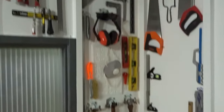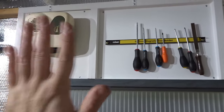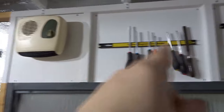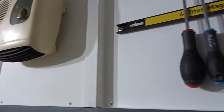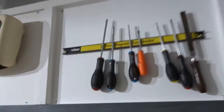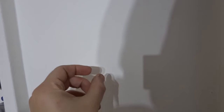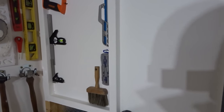The third thing is to board the walls. I've chosen to go inside the studs rather than over the top of them — I'll leave a link to a video on how I did this. It saves space, so you can see the walls are inset and tools sit flush into the wall. This also helps with soundproofing and insulation because it adds an extra barrier. Behind the board there are two layers of bubble wrap, then a cavity — another air gap — so we have board, air gap, then the aluminium bubble wrap creating yet another air gap.